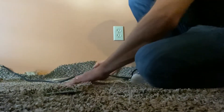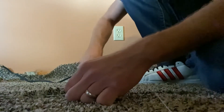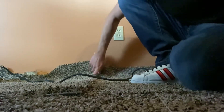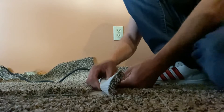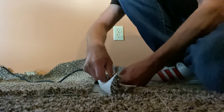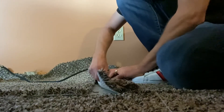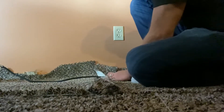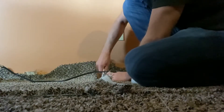Let's burn a seam — I'm going to make this incredibly easy so anybody can follow it. The two carpets I want to seam together: I'm overlapping one on top of the other, tracing the edge of the overlapped one, and cutting little baby incisions into the carpet — creating a connect-the-dots type of scenario. I'm folding it back and tracing my little incisions one to the next, boom boom boom, working my way down nice and slow. You have to have a really sharp blade to have this look good, because if the blade isn't sharp it's going to look like trash. Slowly work your way down cutting through the backing — do not rush. Making all those little incisions all the way down creates a nice easy template for you to follow.